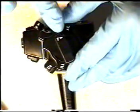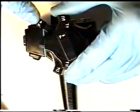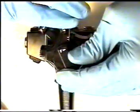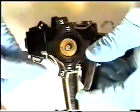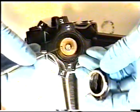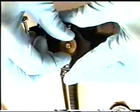If the left-right free cap does not match up with the up-down free knob, in this case we'll need to loosen the 3 set screws again and match it up with the up-down free knob. If after performing this adjustment the endoscope is not locking properly with the left-right, it will be necessary to remove the cap, the 2 nuts off the shaft, and perform the procedure again where you hand tighten the knob counterclockwise and then loosen off to a clock position.